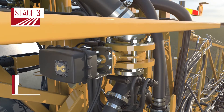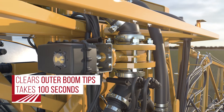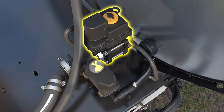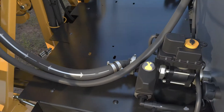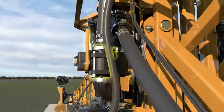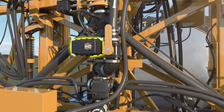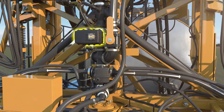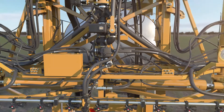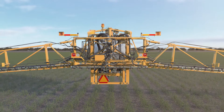Stage three clears the outer tips of the boom. The main shutoff valve is closed so air goes through the reload station. With the recirculation valve shut, air now goes up over the boom tree through the recirculation manual valve. The boom feed control valve is closed, forcing air to pressurize the boom through the lower feed lines. Following on-screen prompts, the operator tilts the booms up and down, starting in the down position.